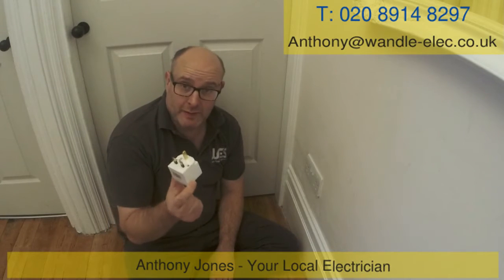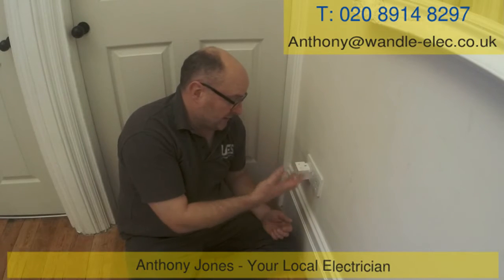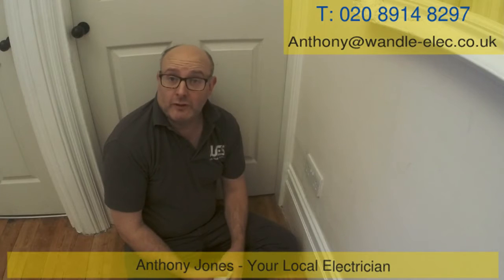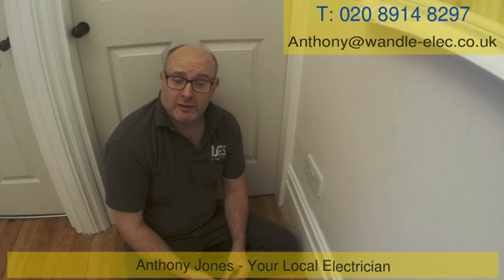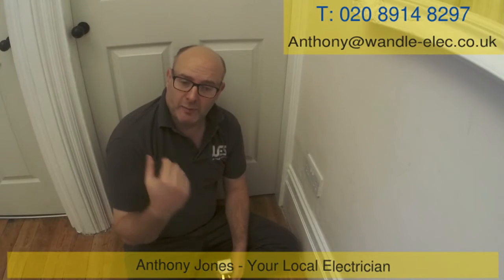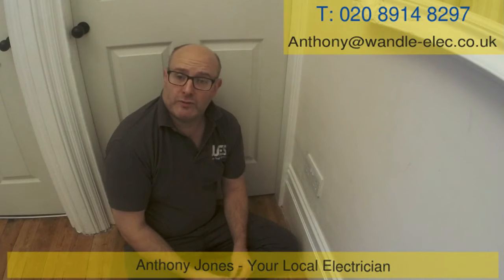These particular ones I've just bought for £1 from the local bargain shop, and they don't have a fuse in them, so you can potentially put two high amperage appliances into this socket using this and overload that socket just through that. Now when the socket's overloaded, it will start getting hot. The key signs, if you're looking to see if yours are overloaded, are scorch marks, the burny plasticky smell, sometimes a fishy smell, and sparking, crackling, all those sort of things are typical of a socket that's been overloaded.